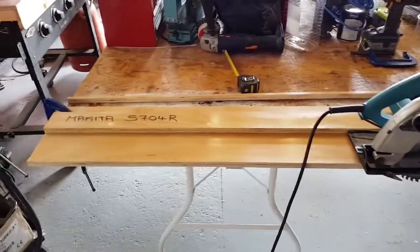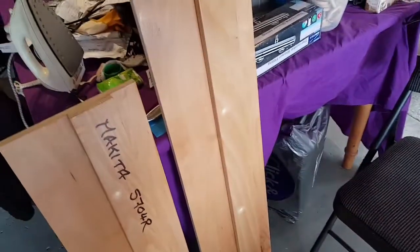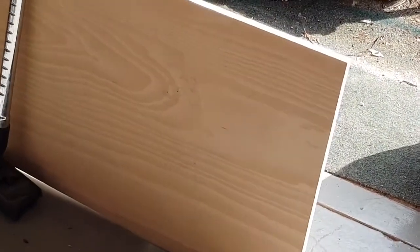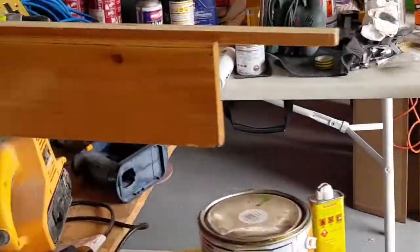Probably 15 pound 75 if you count the varnish — I'm happy with that. I've got three: the 8-foot one for doing full-length sheets, the 5-foot one for cutting across an 8x4 sheet, and then the little baby one just for doing 2-foot rips. So if I needed to chop something, I'd just lay it across where I wanted to chop, make a mark, lay the guide across, run the saw down — done. Right, got to tidy all this up today.